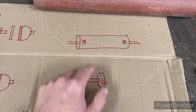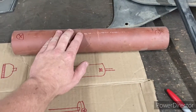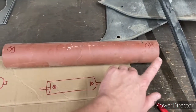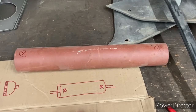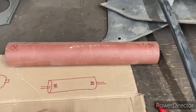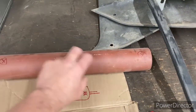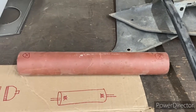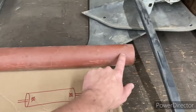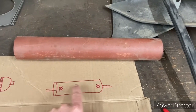or you need to reduce that heavy spot — that's the way to fix it. In our case we've got a rotating assembly. Think of a pipe: if this pipe is true and consistent from one end to the next you'll have minimum trouble because it's consistent in shape and size all the way through. But the minute you start adding chunks of metal at different points, you're going to have issues. When you spin a cylindrical length like that, you need to do a two-plane balance — balance this end and this end.